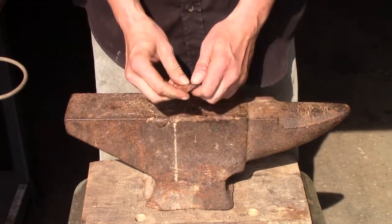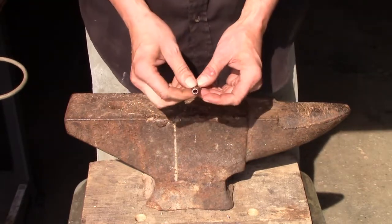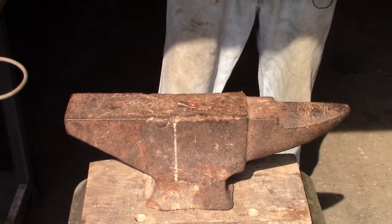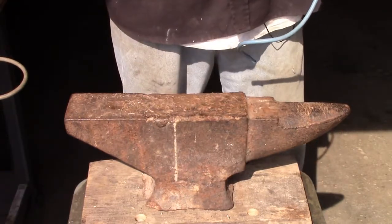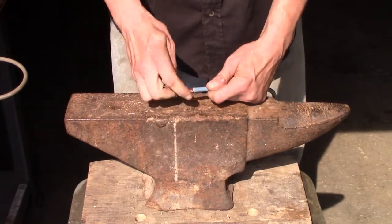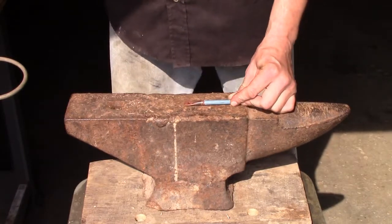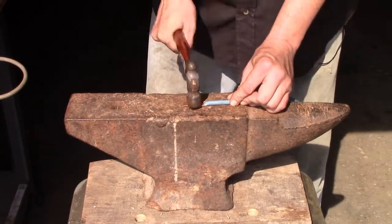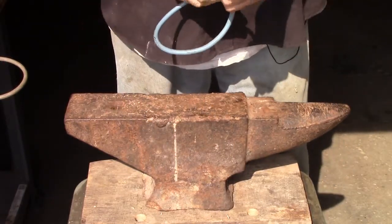Now, if you are using a used piece of copper, you probably want to take a little sandpaper and clean up where it's going to be connecting, and maybe stick the sandpaper inside and twist it a little. Now you're ready to solder it on — or they do make special crimpers for these bigger connectors. Your standard little crimper that comes in your wire stripper/crimper combo ain't going to work for these. So, normally you put your wire in there, and make sure when you choose your tubing that your wire fits into it pretty snugly. But here's another little trick: if you don't have a soldering iron and you don't have one of those crimpers, just do this — hammer it. Ready to connect your battery, or whatever else you need to use it for.